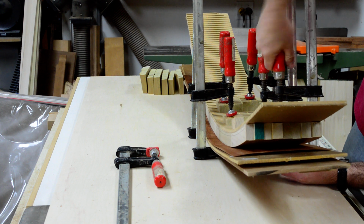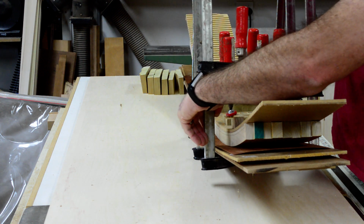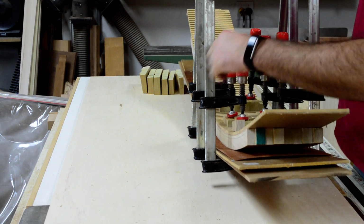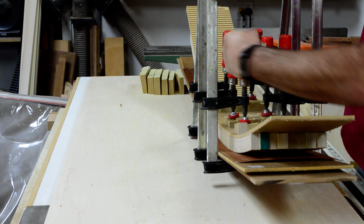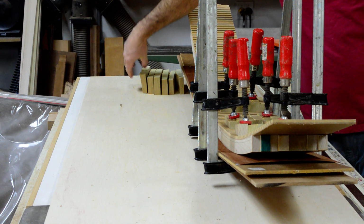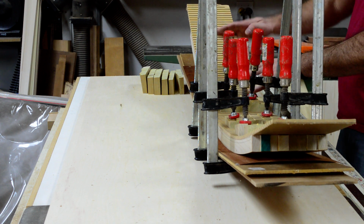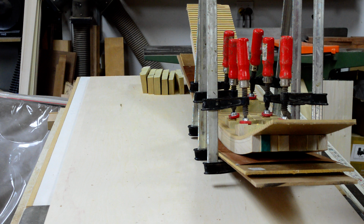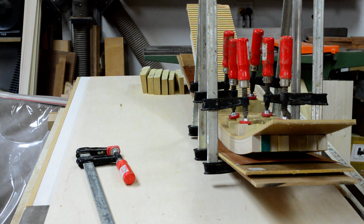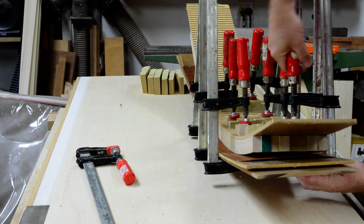It doesn't really matter where I clamp with respect to working your way out from the center and then going all the way to the left, or my left as I'm doing, or all the way to the right. What I want to do is keep working from the center point, because I think the alignment is a little bit easier that way. So from the center and then working my way slowly out to one direction. If I work from here and then way over here, there's going to be a bubble on that veneer face that I can't really get out. And as I said, that adhesive, when it starts to set up, you are really limited with what options you have to correct it.